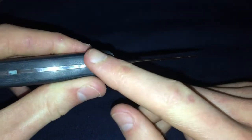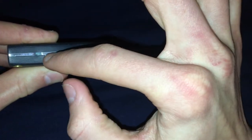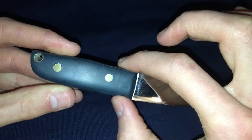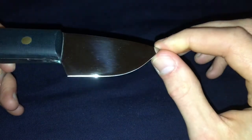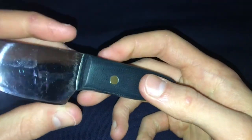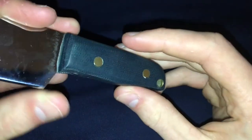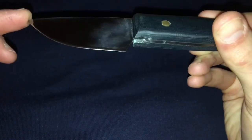Nice and flush around the backs of the spine and into the handle. I actually had a hole here for weight reduction and to let the epoxy go through and bond the two sides of the scales, but when I was grinding and shaping the handle I opened up one of those holes — so instead of a full hole, it went to like a C-shape. Like I said, not perfect, but a really nice knife overall. Probably one of my favorites because of the mirror finish and how long it took to do. Blue canvas micarta scales hand-sanded to 1500 grit, the 45-degree angles at the front to 2000 grit, then buffed with Autosol on a stitched sisal wheel. That's the second knife.